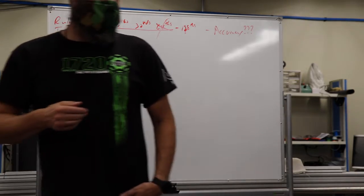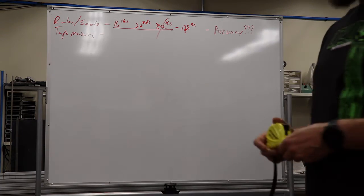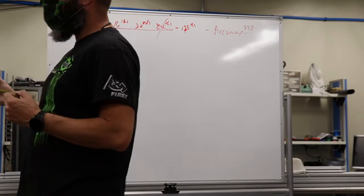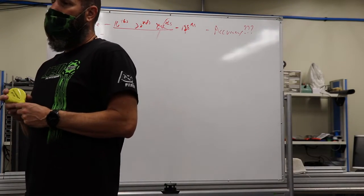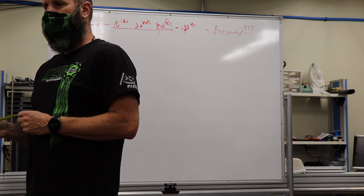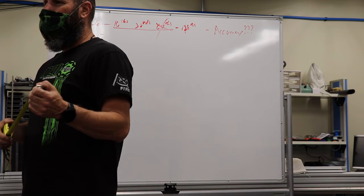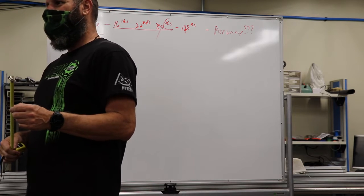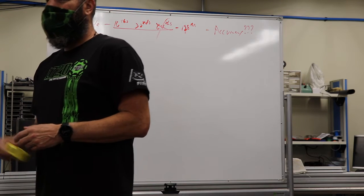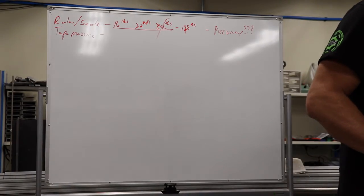Well, it turns out that he was using an import tape measure, as opposed to a good quality name brand. He was using a Buffalo, I think is what it was at the time, which was a real cheap China import. And so the cumulative error over 20 some odd feet was enough that things didn't line up. So think about that when you're doing this. Is this something that I can rely upon to be good?